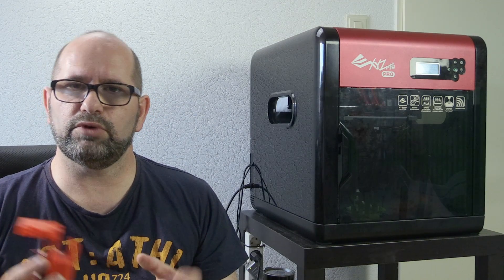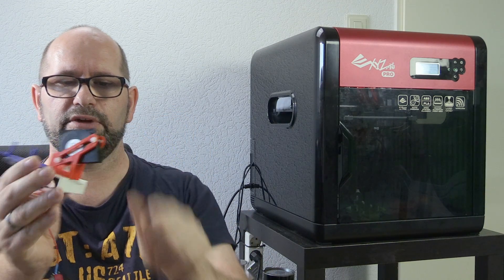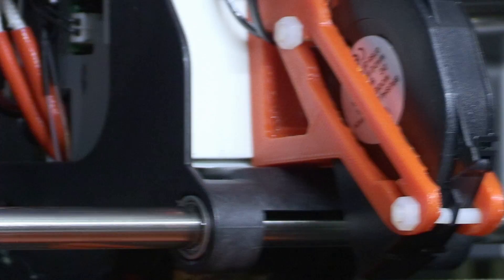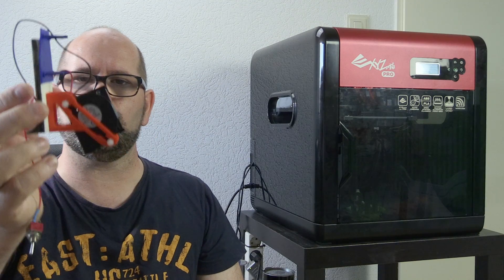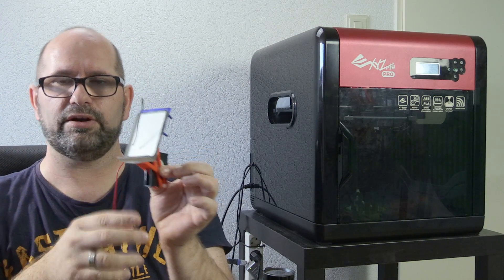So I was thinking, what can I do to have a fan duct that weighs less but does the same job? And then I came across another type of fan — also 40 millimeter fans, but this one is an exhaust fan. An exhaust fan has a directional output. So I printed a few different holders and found that a double holder was the best way to keep it in place. It was mounted on top of my carriage, blowing air right to the nozzle of my printer, and it proved to work very, very well.